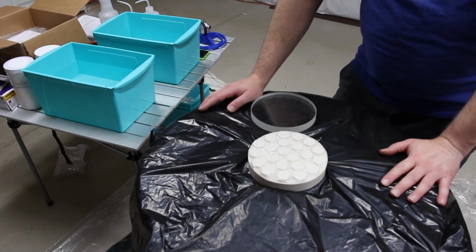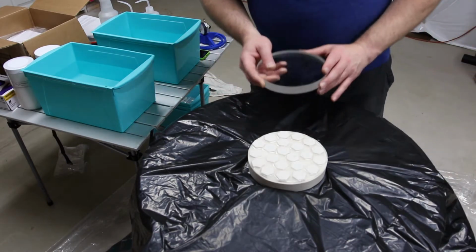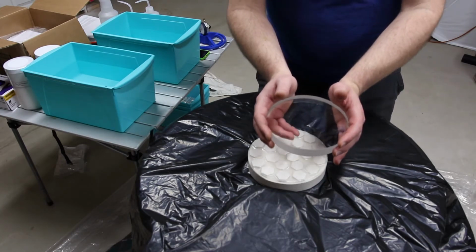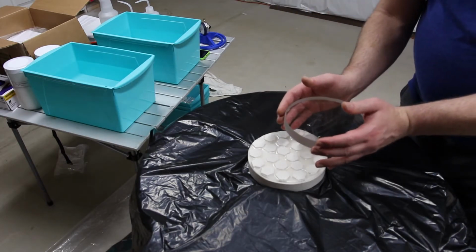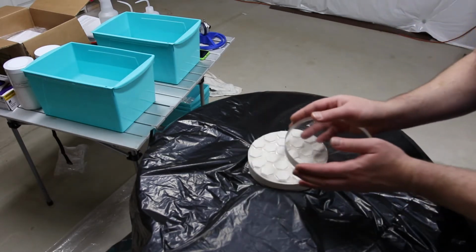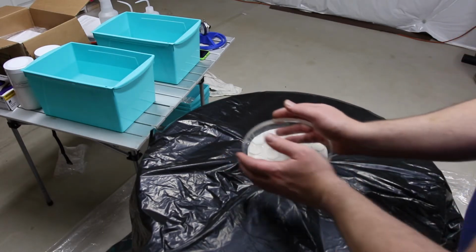That's typically what people would do with a setup like this: as you go, you would grind a series of strokes here, and then you would take a step, rotate your mirror a little bit, and then do some more, and continue that process. Take a little step, rotate, do some more, take another little step, do a little bit more.